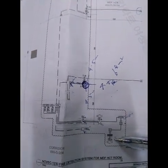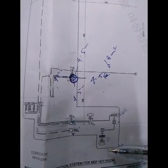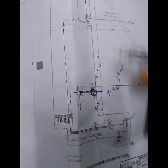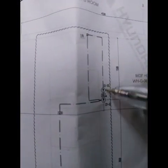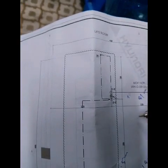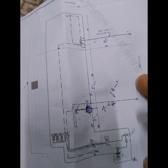The inside EVAC light means evacuate — in case of fire, people must evacuate from this room. The outside light means 'do not enter' — when gas discharges, nobody can enter the room. Regarding detector coverage: one detector covers 4.5 m on each side — right, left, front, and back — giving 81 square meters coverage per detector. That is the procedure for the Novec 1230 system electrical part.